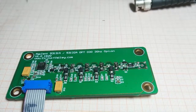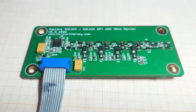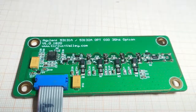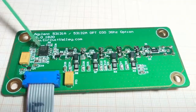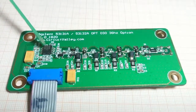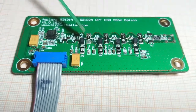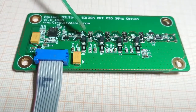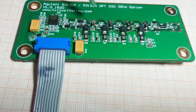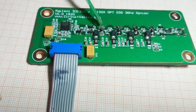My active probe is quite limited in terms of input amplitude, so we cannot probe higher signal levels. As per the datasheet of the MB510 prescaler chip, the maximum signal amplitude is 10 dBm. The P1dB compression point of our RF amplifier MSA0986 is around 10.5 dBm. When feeding a higher signal amplitude, the input into this chip will be limited because of the P1dB point of these RF amplifiers at 10.5 dBm.